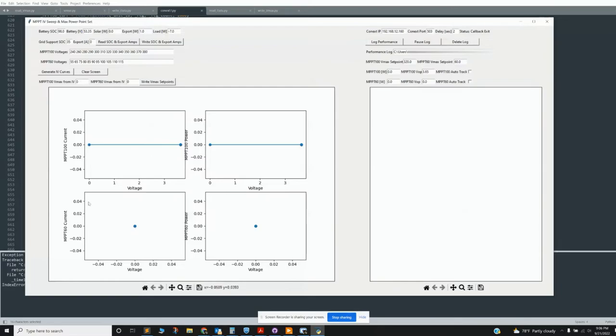There's basically none. These should look like IV curves, but the system is off. There's literally no voltage because the Tigo units essentially shut it down to 0 volts when the whole circuit is connected.